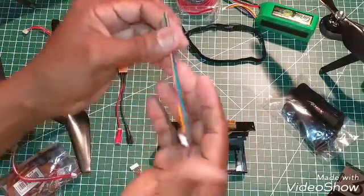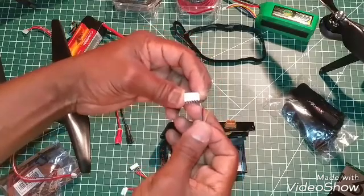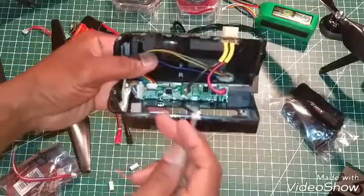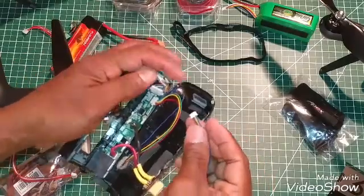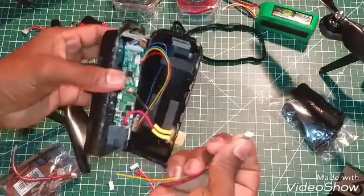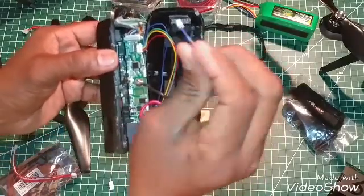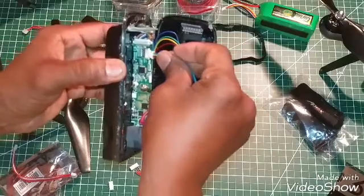I soldered the ends onto the connector in the proper location on the battery, and this other smaller end goes on the BMS plug. You've got to be very careful when you connect this because if you have the wrong direction of the battery on the cells it won't work. If you want to follow my pattern — this plug here you'll find that it only fits one way, and if you pay attention to the back you'll have two little raised notches that plug into the BMS.